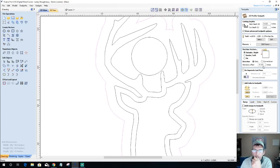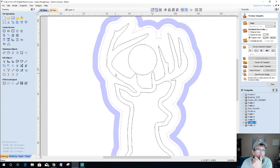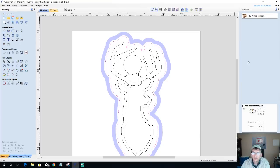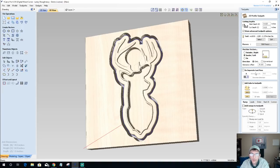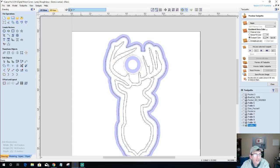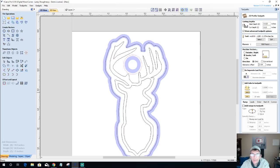Alright, let's turn. I don't think it would be a positive. It's got to be a negative. Because looking at. That's got to be a negative. I calculated the wrong one. Bear with me, gentlemen and ladies. If I make that a positive, see, it's moving inward, away from. So that's not what I want. I want it to be a negative. If anybody sees something that I don't, let me know. Starting at an eighth of an inch, cutting to a quarter. Cutting down a quarter. Offsetting negative 0.125.